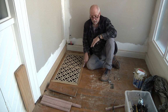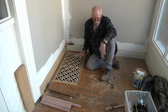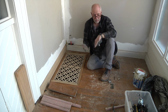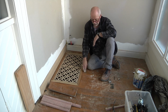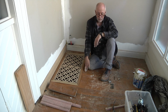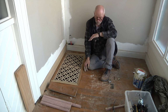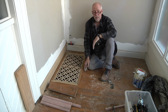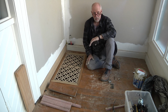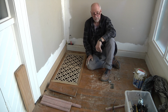It is sitting about 150mm above the ground. I've made sure it's nice and clear all the way around it, so you can get plenty of ventilation underneath the box. The box is sealed to the bottom of the hardwood floors, so that shouldn't be any issues either there. The duct is actually extremely tight inside the box in the opening, so that shouldn't be an issue. I will actually affix the ducting to the sides of the boxes so that it can't be pulled out if anything actually happens underneath the house.